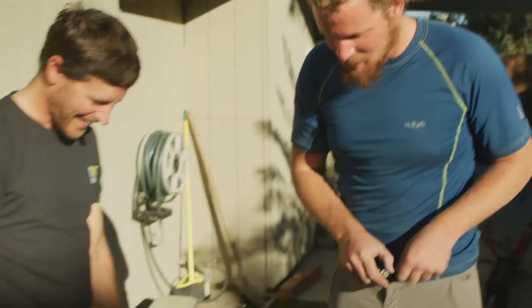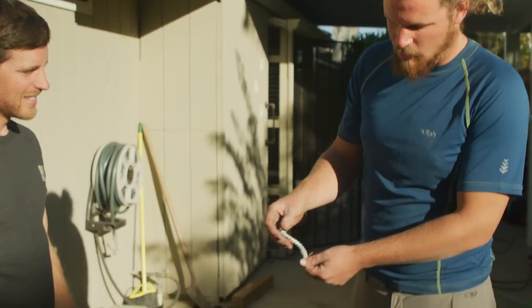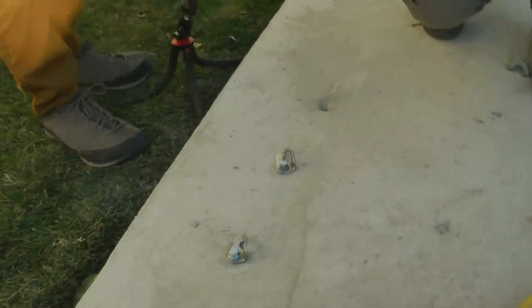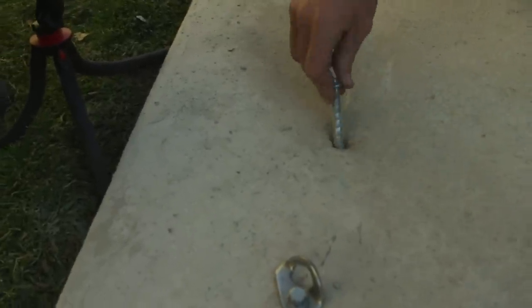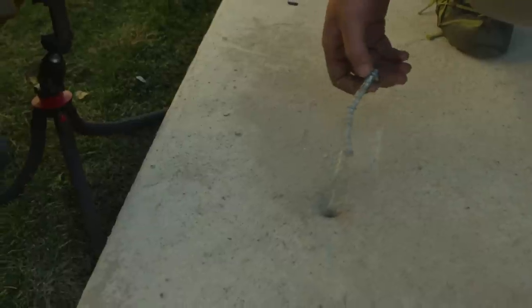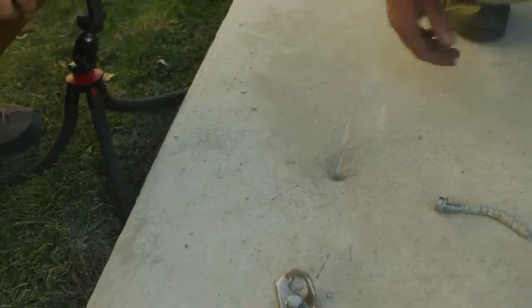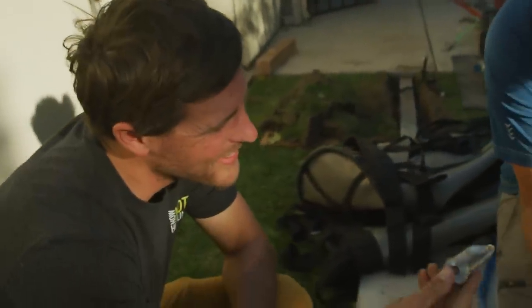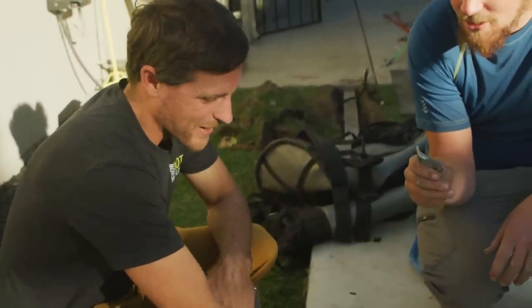So we had our hole fail, actually, the bolt hole interface, which I believe this is either the third or fourth time we've taken it up to 30 or 40 kilonewtons and then put another Titan back in this hole. So, I mean, I'm not super surprised that the hole failed, but it failed at 36 kilonewtons. Is there still life? There's not much life left in this. Yeah, I think we drill another hole and, we got two more.